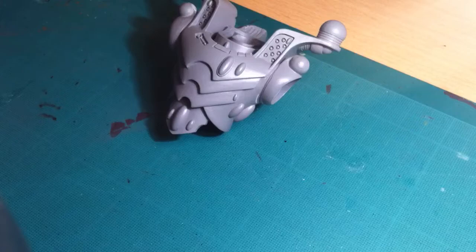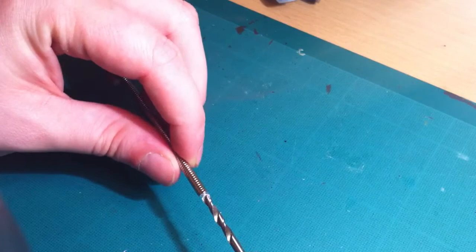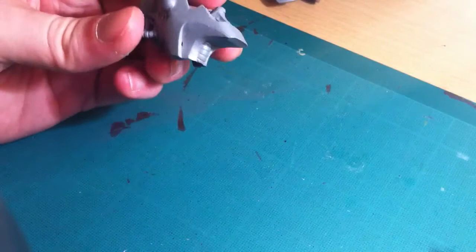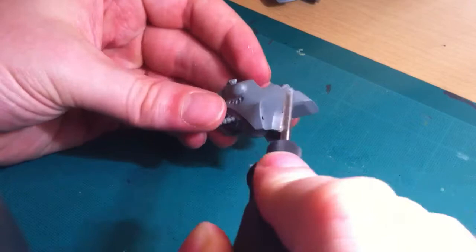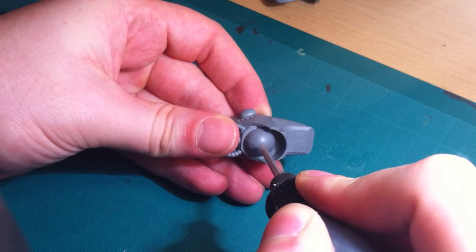One thing to check: the hole obviously needs to be the right size to accept a magnet. The drill bit there looks to be about as wide as the magnets, so I don't really need to do much wiggling to make the hole bigger, which is a good thing. So I've got my drill, I've got the mark where I want to be drilling — let's crack on. Have the drill on a quite slow speed setting; it doesn't have to be that fast. Better to start off slow than too fast. Take some time, because once you start drilling you can't un-drill the hole. Make sure you're happy with the angles, find the dot you're aiming for, and just slowly start the hole and hold it steady. The first bit's always the trickiest whilst it gets to grips.